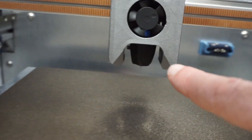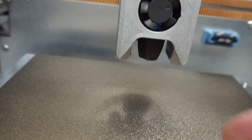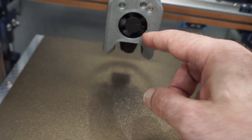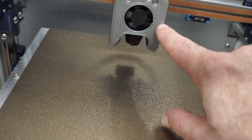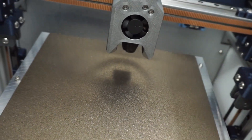I'm using a regular v-zero toolhead that's been modified a little bit — extended to use the Rapido hotend, so the sides are extended down. I also made the front a little thicker to fit a 10 millimeter fan instead of the 7 millimeter fan the stock v-zero toolhead uses.